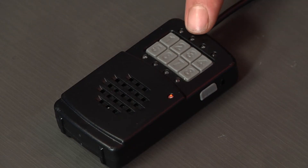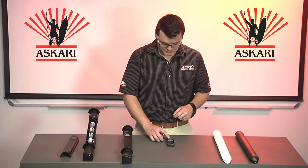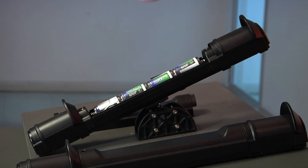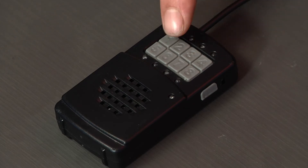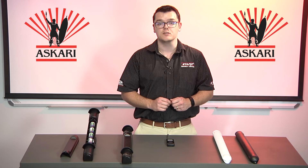We will now see that the programming has been received. To confirm, make sure that the LED is on solid, and once the top and bottom eye have been detected, two beeps will occur as it is programmed into zone number two and the LED will flash according to that zone number.